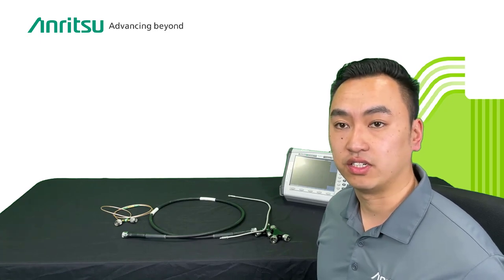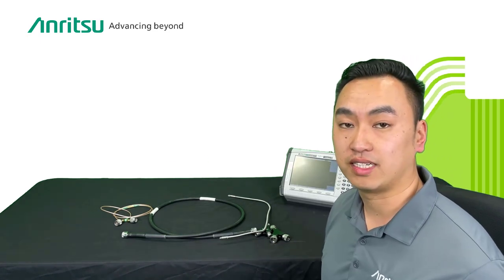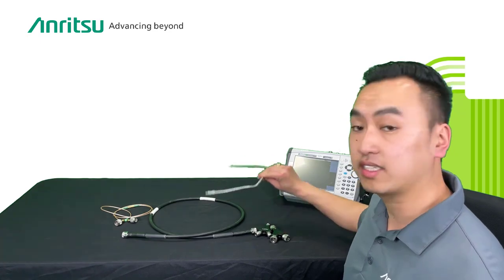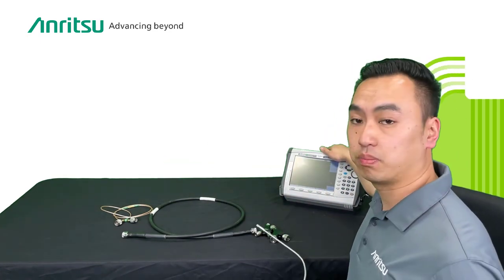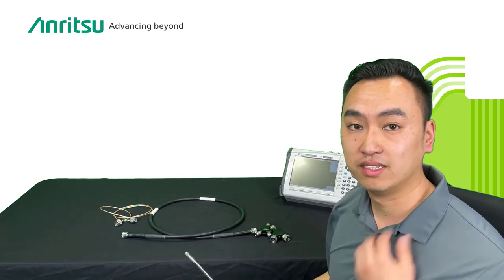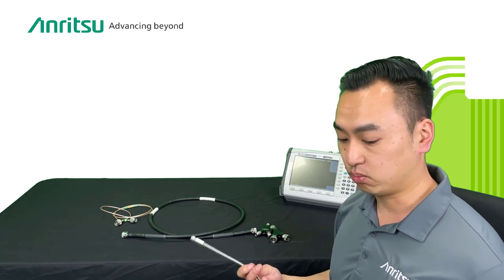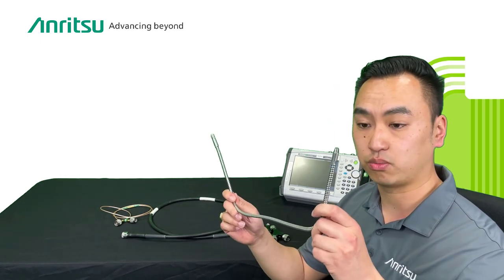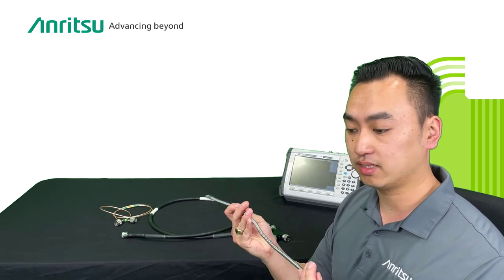What is the reason for this? Most commonly people's response is that something is wrong with the machine. However, typically that's not the case — the most common culprit is actually your test cable. Your test cable connects from your port all the way to your device under test, and these cables matter greatly when doing measurements in the field. One of the best types of cables for measurement is what I have right here, which is known as a semi-rigid cable, and the reason why this cable is the best is because it's extremely phase-stable.